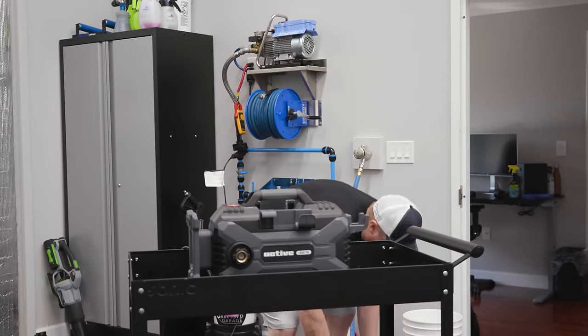Now it's going to vary slightly from machine to machine. When we first tested this with a 4.0 nozzle, we got 1,070 PSI. Right now I'm getting like 1030, 1025 PSI out of it. And a simple way, this is the test that we used on all the pressure washers, was to do a timed test for flow. I cut a hole in the bucket here and I'm going to weigh it after a minute. So let's start our stopwatch. 3, 2, 1, go.